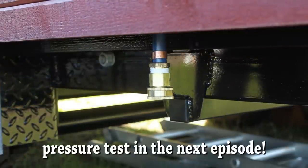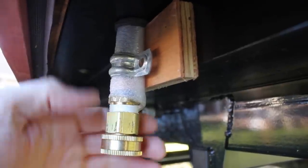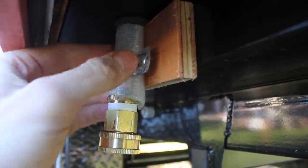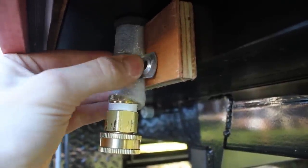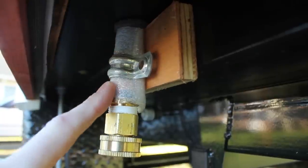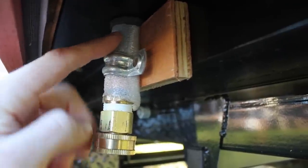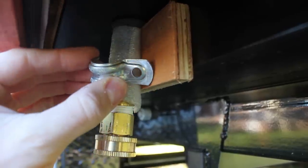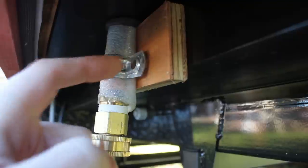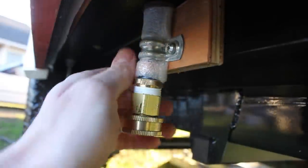It's time to pressurize the system and see what happens. I realized the little inlet stub-out, if the hose got yanked really hard, could pull and put all the stress right on the PEX itself. So I figured out a system to secure it — I took a piece of plywood to be a shim and fill the gap between the metal of the trailer and the pipe. Being picky about insulating the pipe as much as possible, I wrapped some sill gasket around it, which also helps snug down an electrical metal tubing strap that fits snugly over the wrapped insulation. I just need a screw through the wood into the trailer to hold that down tight, and then there's no way it's going to get pulled off. Nice and secure.